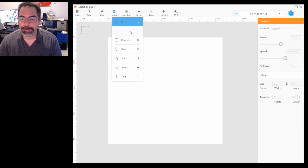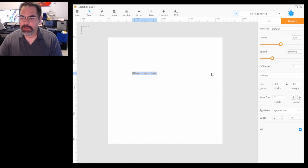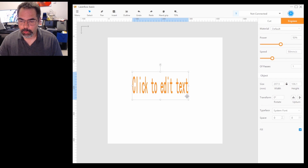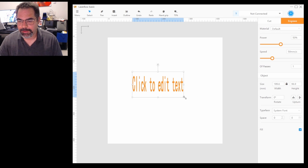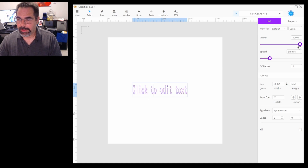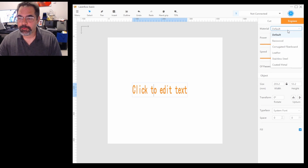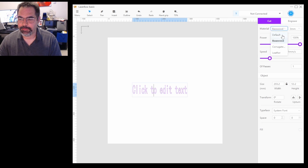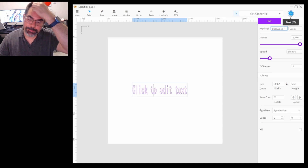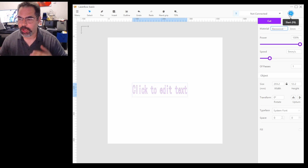You've also got insert for all your basics — line, rectangle, and so on. The most important one is text, since that's probably where you'll do the most things if you're personalizing stuff. If you hold down shift when you resize the text, it will lock and scale it without warping. This is the engrave setting. If you click over to cut, anything that's a cut is shown in purple, and the power and speed are adjustable for each. You've also got materials presets — if you go down to Basswood it's got presets for cutting, and for leather it will increase the speed and lower the power. It's nice to have pre-built material settings and thickness options.